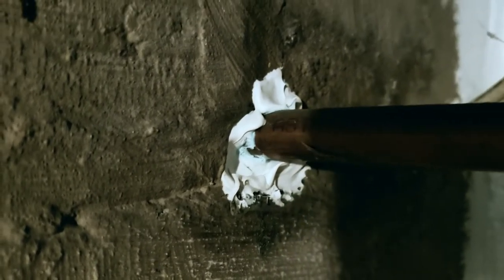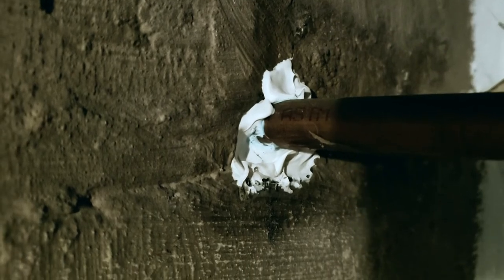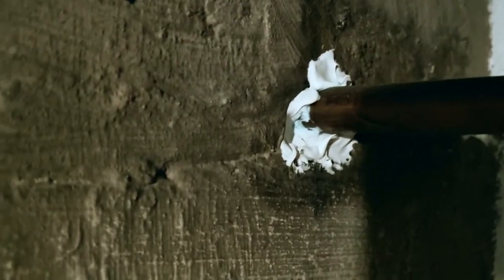All the way over here, down here. You can see a little discoloration in there, and that is because there was a slight chemical interaction between the silicone I used and the copper pipe. It's not a big deal, just minor discoloration. A little bit of that coppery color bleaches out.